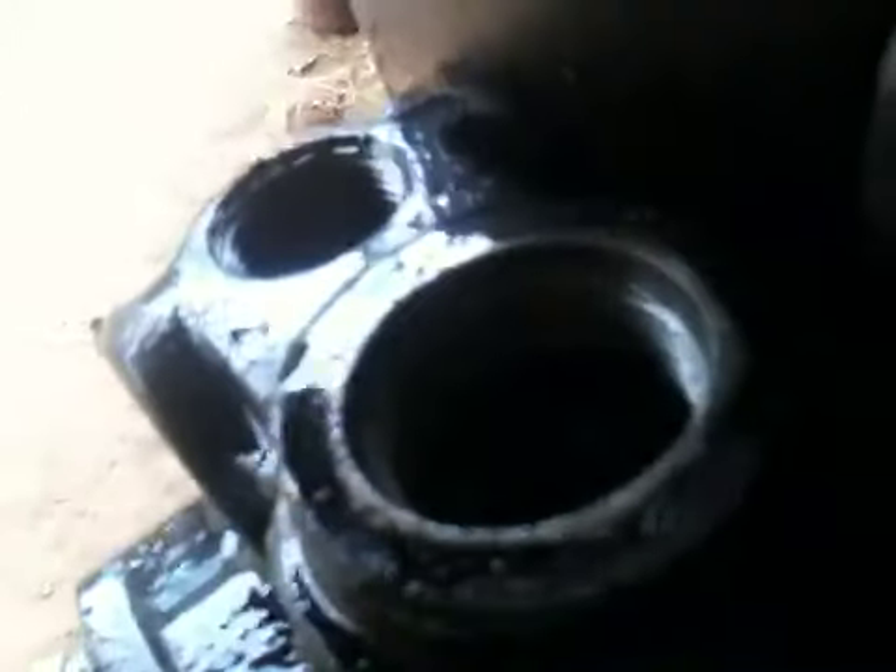However, the return line on the valve is connected to the power beyond, and there's actually a connection in there. You can see it from this side better — hard to see in the dark — but these two outlets are connected. They are not connected once the power beyond fitting with this O-ring here is inserted in there.